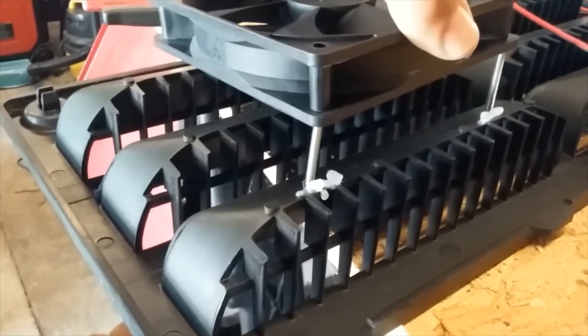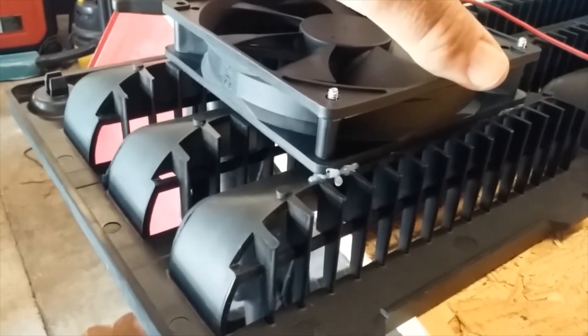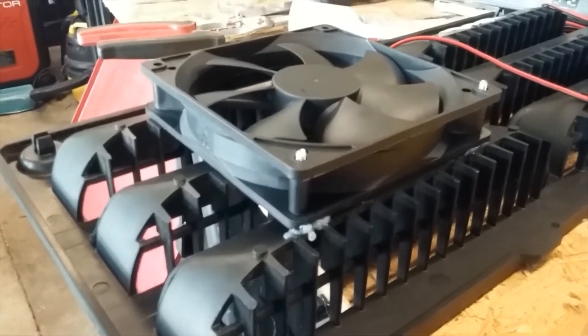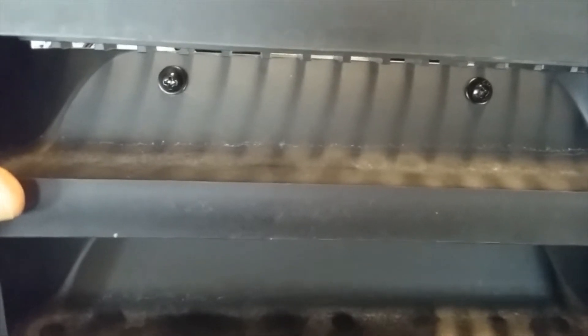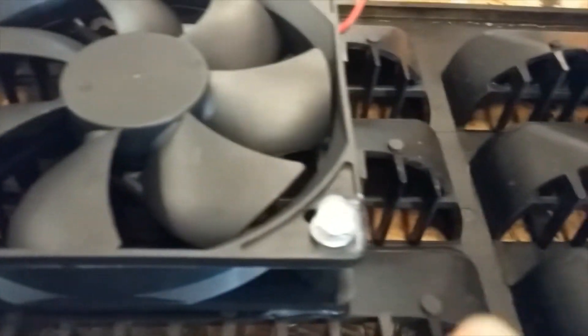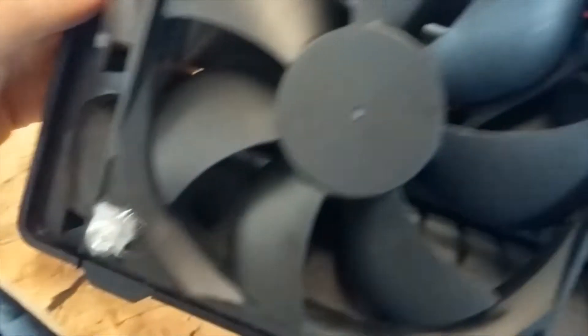We place the fan on and top it off with nuts and flat washers. You can see the fan up in the vent now — the screw heads and washers were painted black so they blend in. We tightened the nuts on both sides and applied silicone to help hold them so they don't vibrate loose. At the bottom, instead of screws, a bead of silicone acts as an adhesive to the vent, which also helps with vibrations.